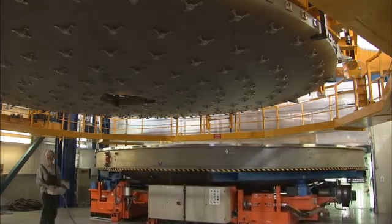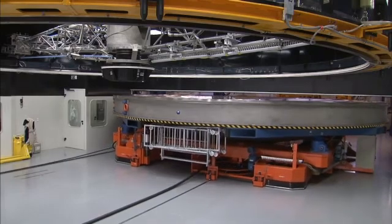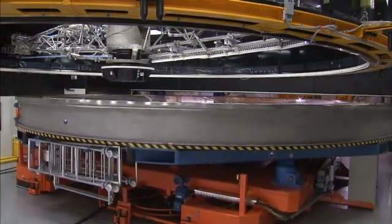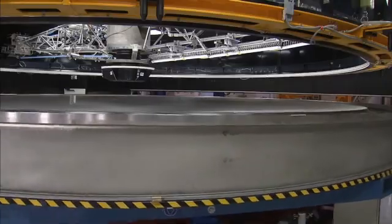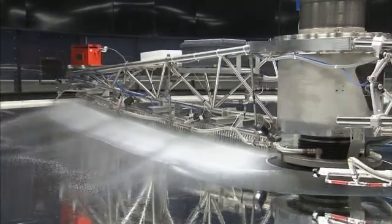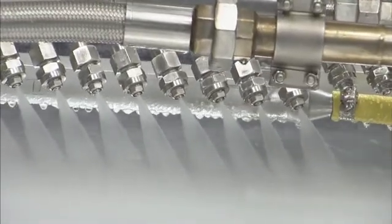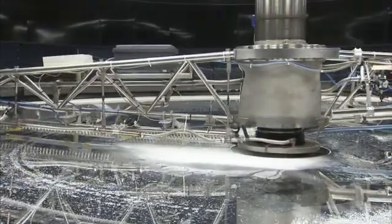Afterwards, the bottom half of the vacuum chamber is brought in, and the mirror is carefully lowered into it. The mirror is next taken into a clean room. The first action in the clean room is to treat any badly polluted areas on the mirror manually. This requires a steady and skillful hand in order to avoid scratching the surface. The point of doing this is to remove any particles that might not be easily flushed away during the subsequent washing. Afterwards, the vessel holding the mirror is positioned in the washing chamber, where the old reflective coating of the mirror is washed off. The washing process begins, and a giant purpose-built sprayer arm rotates just above the surface of the mirror. Ultra-pure water and chemicals are used. Under the critical eye of the optical engineers, the machinery does a flawless job, and the operation proceeds smoothly.